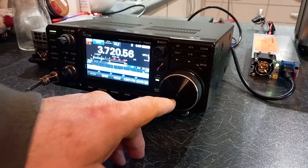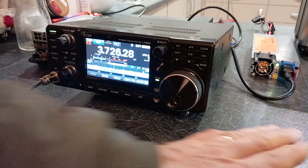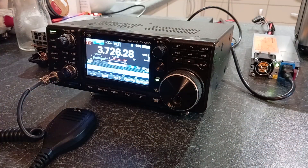We've got S5 to S6 noise peaking at S7 — that's about right for 80 metres. Sometimes it's a little bit lower. The type of radio obviously makes some difference; the IC-7300 being an SDR has very good noise-cancelling ability. I've used these power supplies on the TS-590S, an IC-740, a Yaesu FT-757GX, and the Ten-Tec Argonaut 525 — none of them suffer with noise.